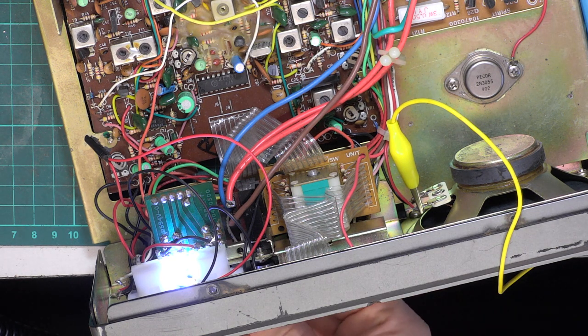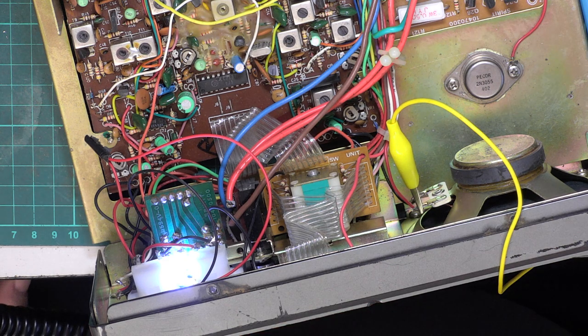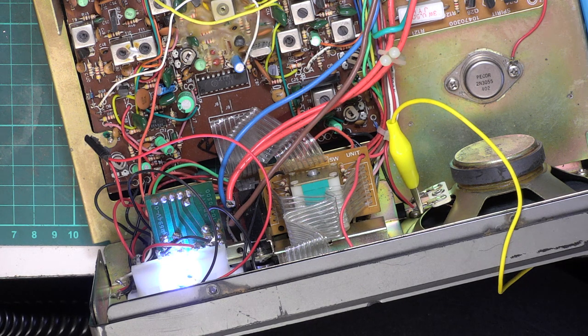Let's look at it at the far end. See whether it's any good. So we've got the squelch now on full on the radio. So we've got 1 microvolt, 3, 10, 30, 100, 300, 1, 3. It's one of these that never ever opens. No, I can't make it open on full. Oh, it's just come in. So we've got the thing on full chat. Well, that's no good to us.